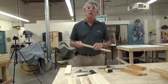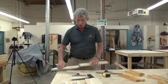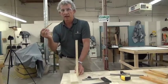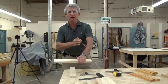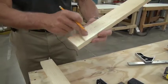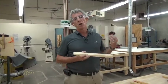I'm going to start off with a rabbet joint — that's wood taken away just on one side. I can just line those up, take my pencil. Rule of thumb: you should be able to poke yourself and feel like a needle — you want a nice sharp pencil. I want a nice thin line; I don't want a wide line. No pens, no sharpies. I'll either go to the table saw or the radial arm saw — you're going to find what works best for you. Rule of thumb: depending on what you're making, don't go through more than half.